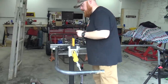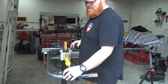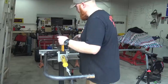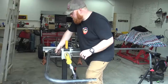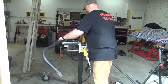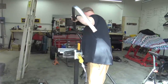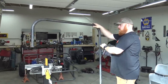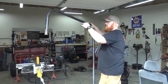You've got to make sure - we messed up a piece of pipe on our first day bending because we forgot to level this one out. You want this one level so your 90s aren't cockeyed; we messed up the first time, but it's okay. So we just need to cut nine and a half inches off of this, then notch each side, then we can tack this in place.